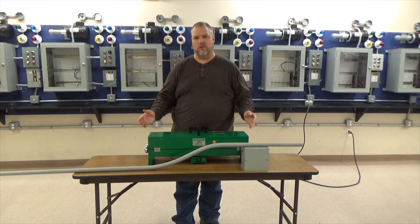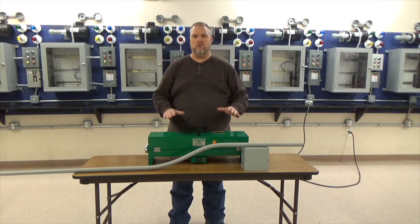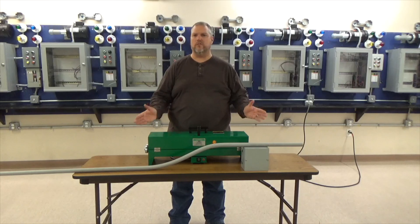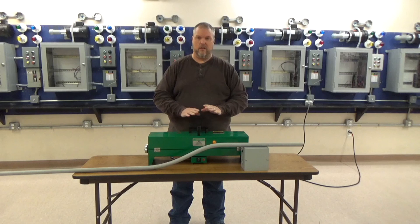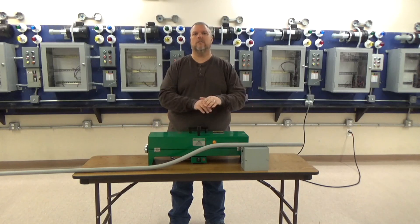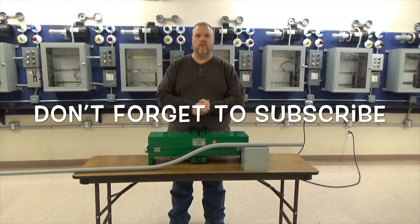This heater is about $400. You start getting into the four-foot and you're looking at a thousand dollars or more, so a hotbox is not cheap. When you get on a job, you want to take care of your hotbox. Make sure it's run on a 20-amp circuit. Some of the bigger hotboxes you're going to have to run 230–240 volt, depending on the situation, location, and type of heater you're using. I hope this gave you a great understanding on how to bend PVC conduit with a hotbox. A few simple rules to remember: always keep the conduit moving, don't let it sit, let it get pliable, then let the conduit cool itself down — once it's cooled, you're good to go. If this video helped, give me a thumbs up. If you have any questions, leave a comment below. My name is Craig Michaud, the electrical instructor — have a great day and be safe. Thank you.